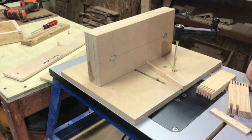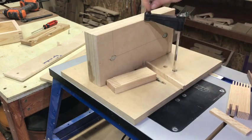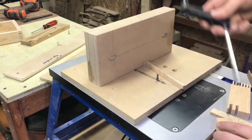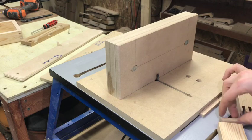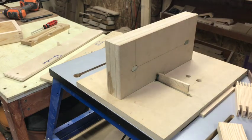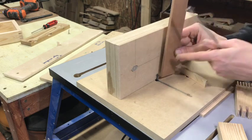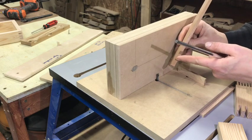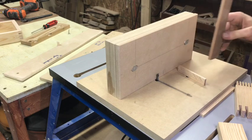So obviously then, if you're using a significantly thicker piece of wood, you're going to have to go up much higher, right? So therefore, if you route this groove super high and put a super high piece in there, you'll no longer be able to use thin wood, because you will then be putting a finger this long in there, whereas your mating piece is only going to be this thick, so your finger only needs to be about the thickness of this.